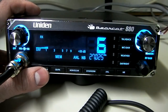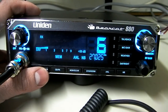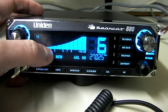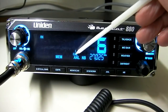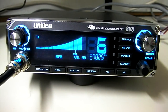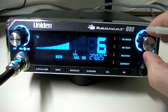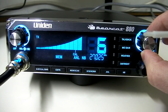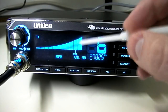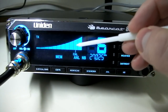In receive mode it shows S for signal strength, and in transmit mode it shows TX and our output level. In calibration mode, you'll see a calibration mark. What you do is key the radio, then turn the channel frequency knob until you've got bars going up around the calibration area. You'll want to do this without talking and without any background noise — you can actually turn the microphone gain down for best results. We'll go right near the calibration level. It may not line up exactly since these are larger bar graphs and can't be that precise.